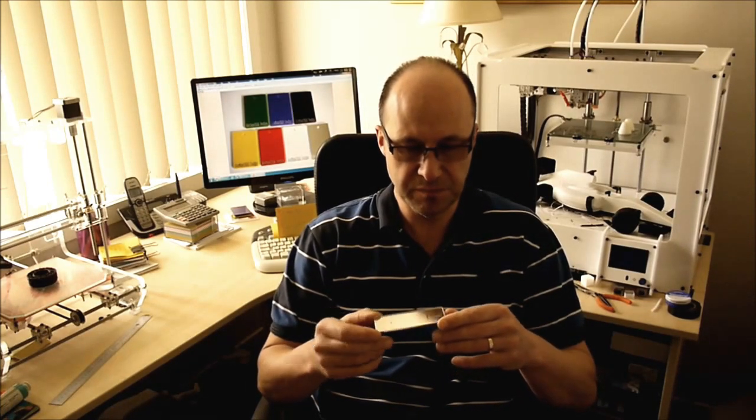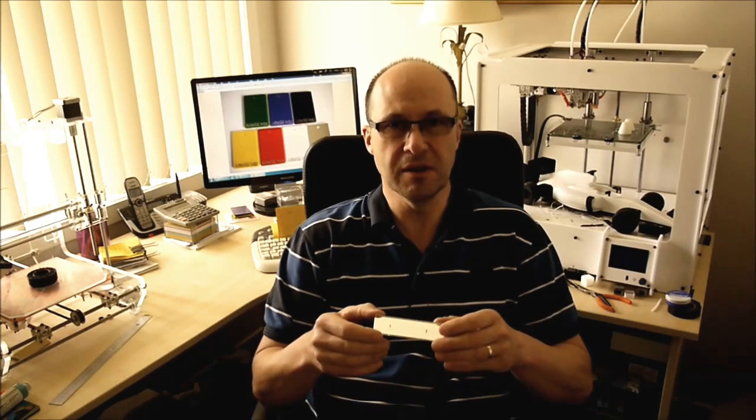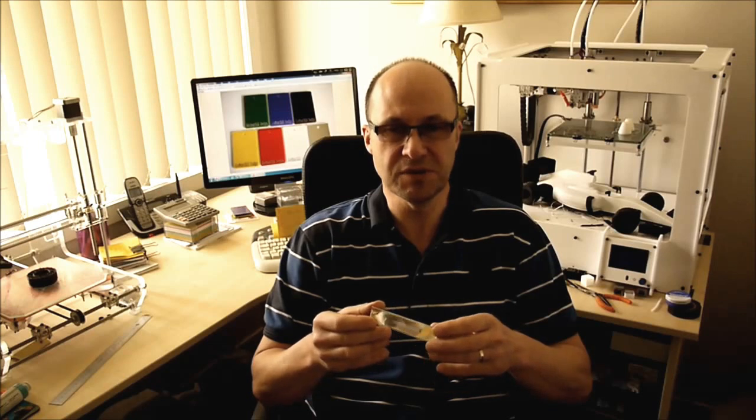I hope you enjoyed that short video — just a quick one to show you the basics. What we've done was mainly set up the laser for acrylic, but obviously there are far more materials you can cut and engrave onto. It is a case of experimentation, especially with machines where you don't know your optimal heights for cutting — if it's a machine from China, you won't know those settings. If you're going to buy one of the professional machines, they'll have already done all the testing and will have different settings within their software for cutting particular materials.